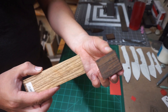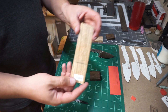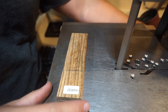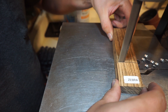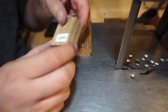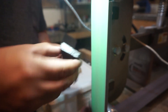Now we're gonna go ahead and use these two pieces and figure out how much we need to cut off of the zebra wood. We're gonna take this over to the bandsaw and cut through both of these at one time — it doesn't have to be an exact cut. We're just gonna cut this and basically we'll be left with almost the same exact amount of the black palm that we have. All we're doing right now is squaring them up so that whenever we go to do our glue up, everything is flat and even. We just repeat the same process on the zebra wood that we did on the black palm.